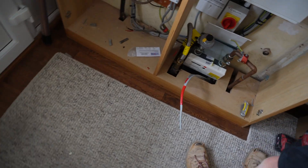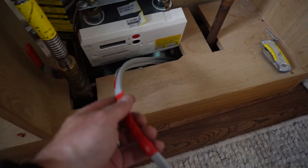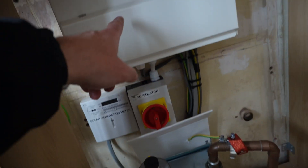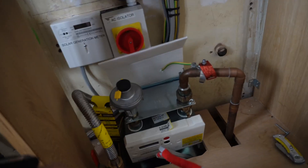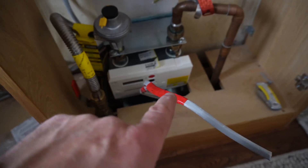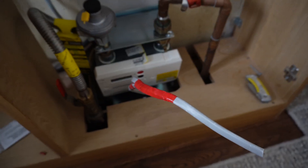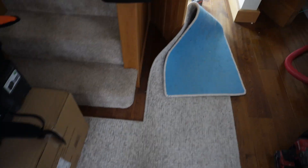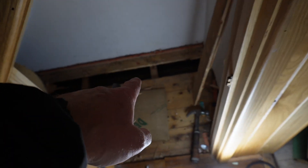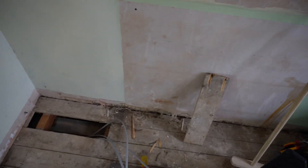Let me show you down where Kian is. We've come up to here now, so all I need to do is make sure the cables are long enough to go inside the board. Then we can leave that well alone, dress it all in nicely and put the unit back once we've pulled all those in and re-routed where they need to be. Where the cables come underneath the joists, we're going to keep them off the floor by putting a bit of banding strap underneath and just holding them all up. Then we can start rattling through.